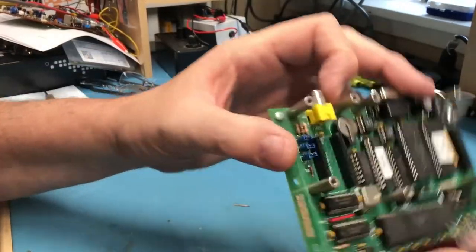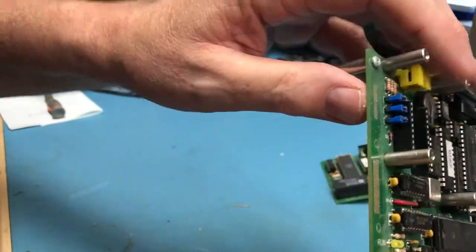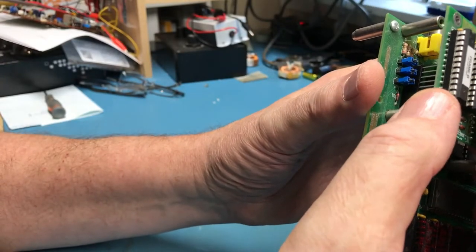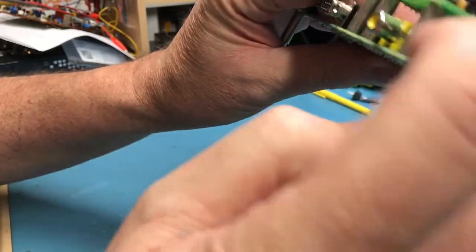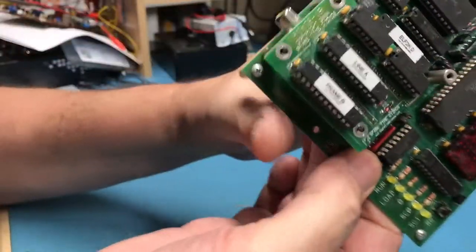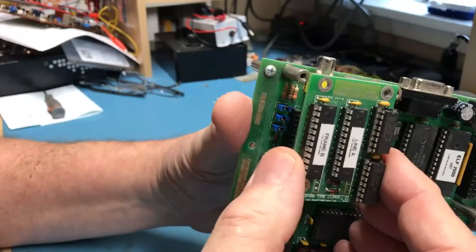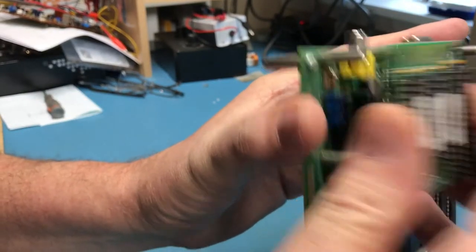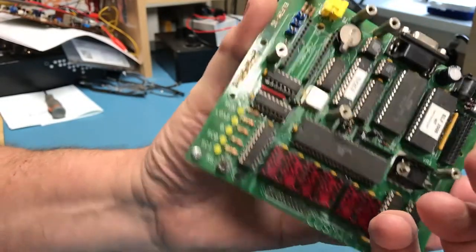This is just simply set up. I've got these wire wrap headers here to get some height. I used long pins, and the long pins just simply push down into the wire wrap socket. There's the standoffs, of course, you see here, and you could screw the board down. So that was the way I chose to mount these little daughter cards. It was just, like I say, a tall wire wrap socket and long 0.1 inch pin headers.